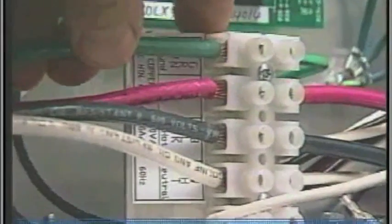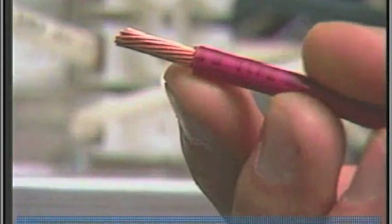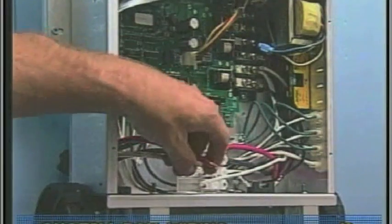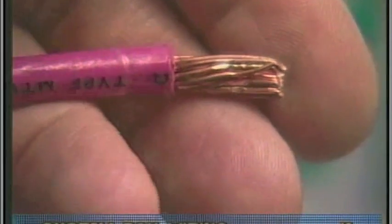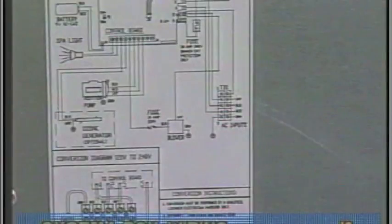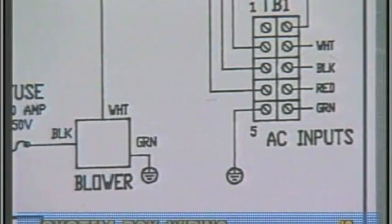When inspecting wiring for any control system, connections for the incoming wires are clearly labeled at the main terminal block. Check for proper installation. 30-amp service must use 10-gauge copper wire. 40-amp service must use 8-gauge copper wire. And all Balboa control systems wired to a 50-amp circuit must use 6-gauge copper wire from the house breaker box to the main terminal block. The wiring diagram inside the system box shows this as TB1.